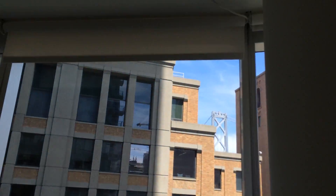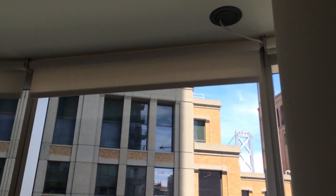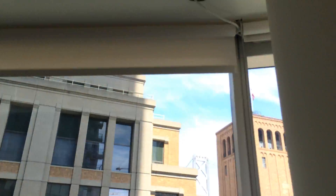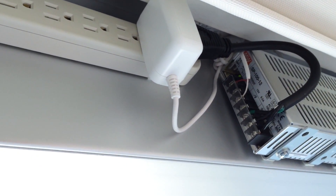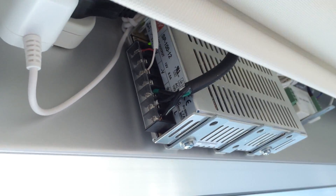I'm going to show you my final lights setup. We have windows across the living room with some space between the curtain wall and the concrete to put the LED strips. I've run power over here from the ceiling to behind this big pillar. We have a power strip right here that both the power supply and the Philips Hue light strip controller are plugged into. The power supply is 100 watts and it converts 120 volts AC to 12 volt DC, which is what the light strips run off.